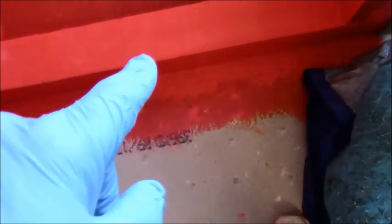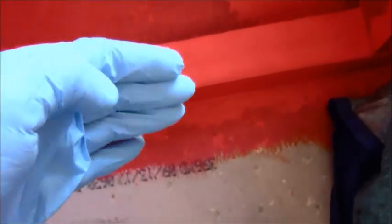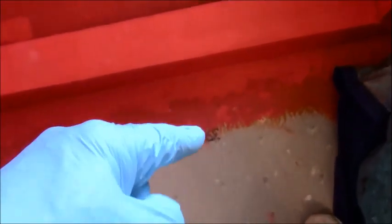And the reason for that is because anytime I see damage, it's to curbs, it's to knee walls, it's to benches, if there's one here, and it's also to the wood below here, the subfloor. So I want to make sure if any water does get up and around the curb, that is prevented from getting into the subfloor. And that's why I do that.